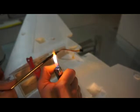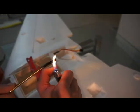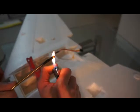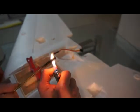and then you can just use a knife and cut that out later. Okay, so while the battery mount glue dries, we can start to cut another cable channel, and that will be the channel for the batteries going to the EasyOSD current sensor or to your ESC.